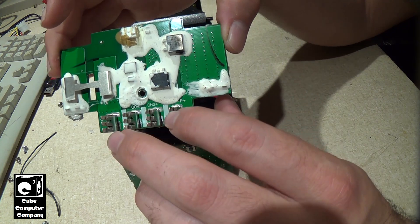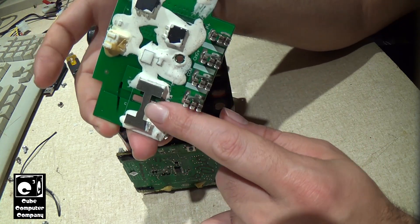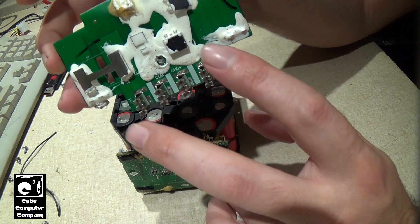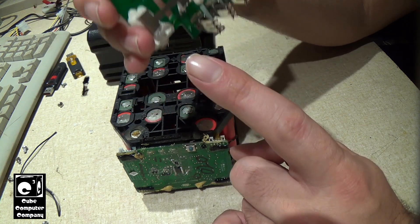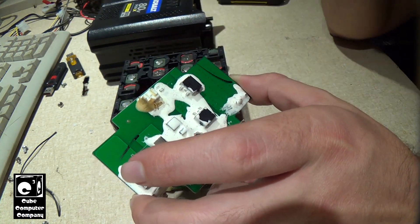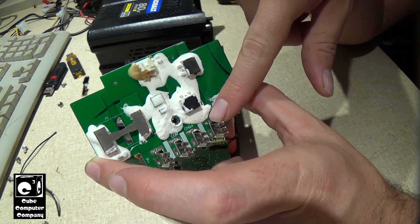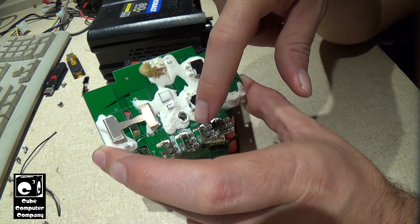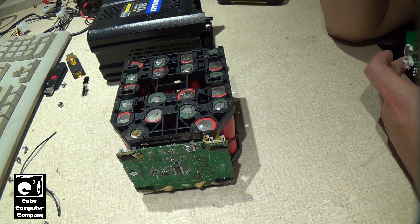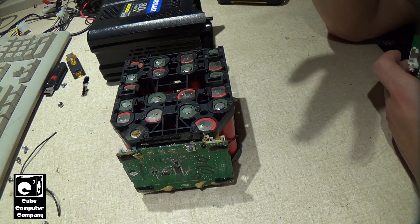You also have a secondary board. It has a fuse — a big piece of metal — that will blow if you get a short circuit, hopefully. There are also two MOSFETs: one switches the power positive connection on and off, and a second switches the charge positive connection. In my opinion, this board should have permanently locked the pack out as soon as it detected a problem.